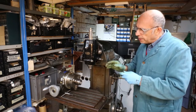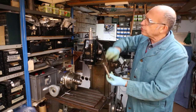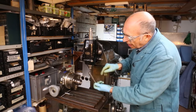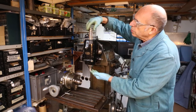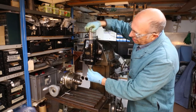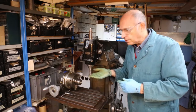However, all is not lost. At the moment in that number four Morse Taper in the vertical head I've fitted a collet adapter. Here's one of the collets — they have a special thread that goes into the draw bar. So the collet adapter is in the number four Morse Taper, we push the collet in, turn it until a pip on the inside engages in the slot, then it goes up and we turn the draw bar onto that thread. Now we have a collet in the vertical head. We can put a milling cutter into that collet and there's a fair bit of room between the table and the bottom of the cutter.